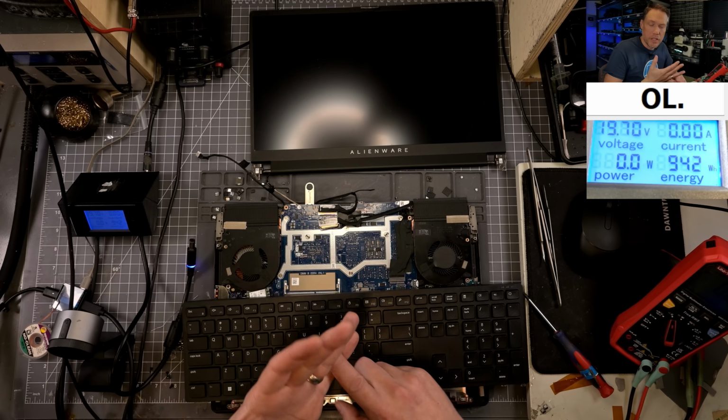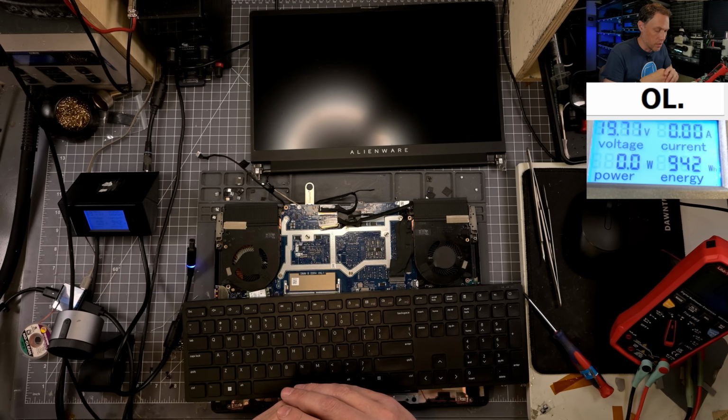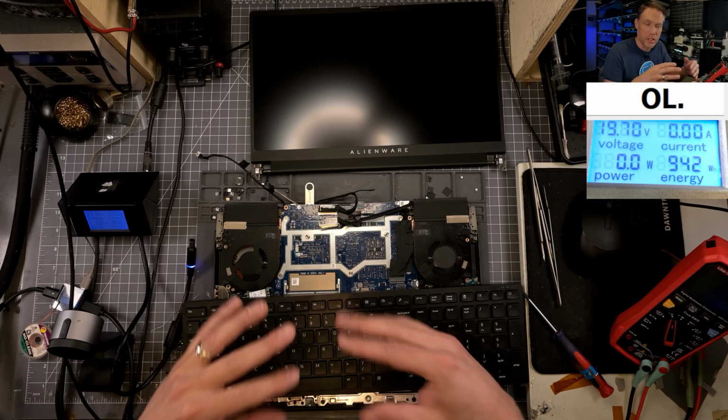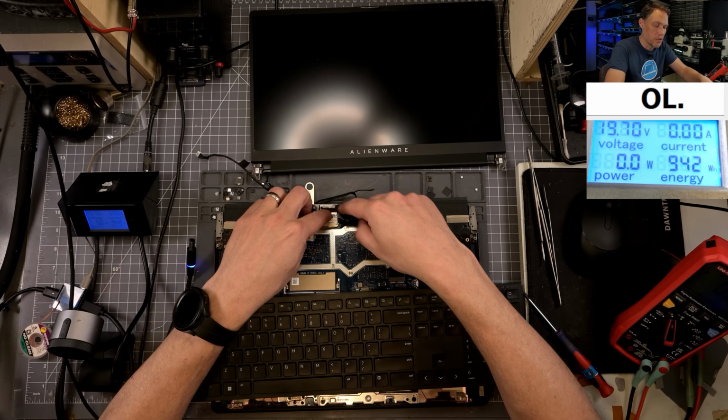So good news, we did get this laptop fixed up, and I'll replace the screen, and we'll get all that stuff working. I'll talk to them about the LCD connector, but if the LCD connector is working, I don't think changing it out is gonna change anything, because those little mounts are not gonna be mounted any better, because there's nothing to solder to if it's been ripped like that. All the pins look like they're intact, and it is making connection with this test screen.